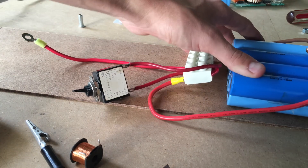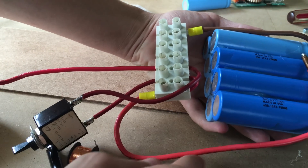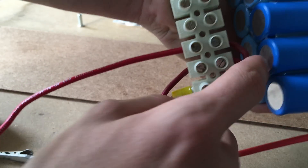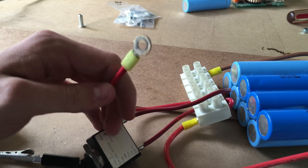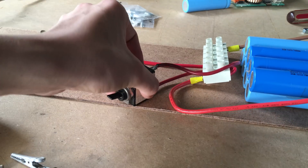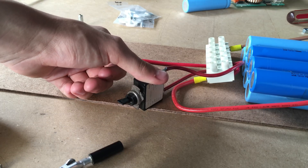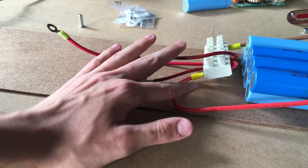So this is the setup. We've got the capacitor bank back here, connected to a terminal strip. The positive lead coming off the capacitor bank goes into the first terminal, gets bridged in the back to the second terminal. From the second terminal it enters the bottom terminal of the switch, goes through the switch into the top terminal and into the third terminal on the terminal strip, and then from that terminal out to the discharge wire. There's going to be a direct hardwire connection from the negative line directly to whatever load we're going to use. Depending on how much current the switch is rated for, it's either going to pass all of it perfectly into the load or it's going to explode. Because of that danger, I'm not going to be standing near here when this thing goes off. A schematic will be in the description available for you to read.